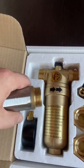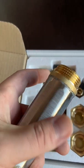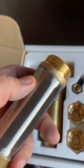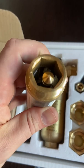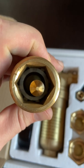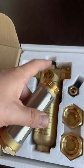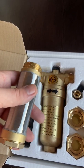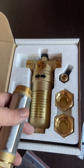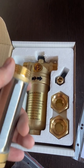This works opposite to cartridge filters without drain valves. The water goes in, around the filter cartridge and around this microwire. Everything smaller than one micron passes through the microwire and hits the magnetic water structure, which provides very good water softening and conditioning. Then it comes out the exit point, and the sediment, particles, bacteria, and dirt are flushed out.